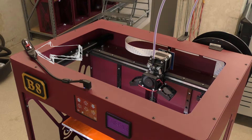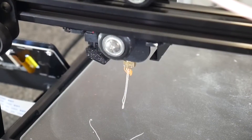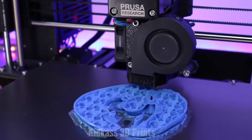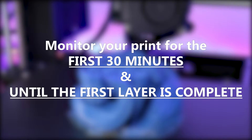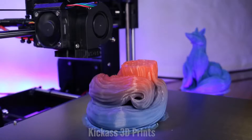At this point, you will attach the flash drive to the printer and load in the proper filament for your part. Perform any necessary calibrations and then begin printing. This process could take anywhere from several hours to several days, so plan accordingly. You are required to monitor the status of the print for the first 30 minutes and until the first layer is complete. You will then check out of the Makerspace and return when your part is complete.